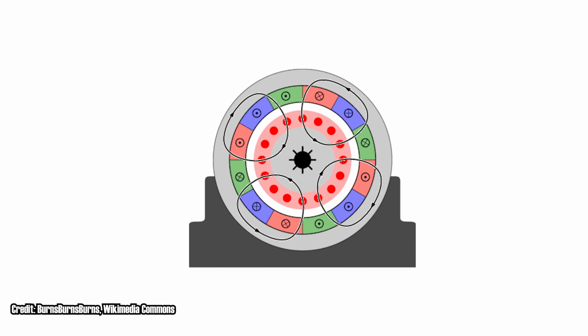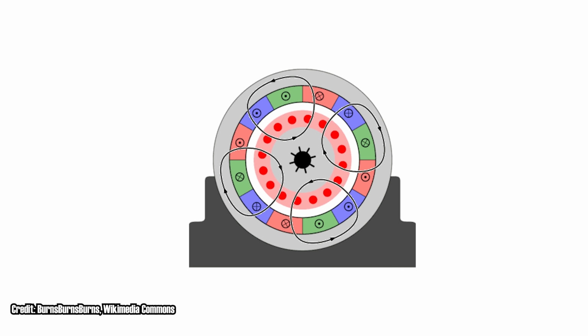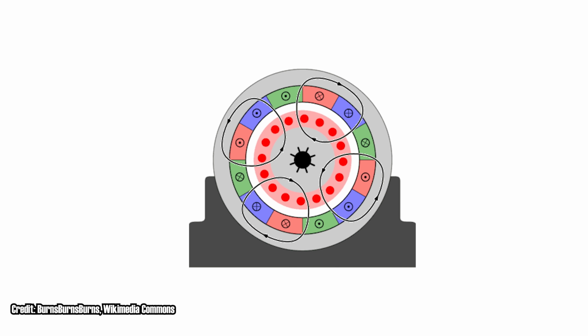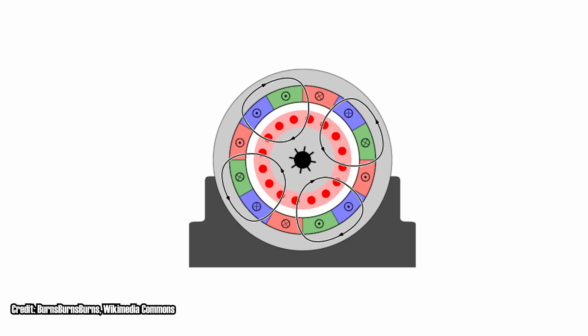In contrast, a stopped three-phase induction motor will immediately produce torque when it receives power because the field is rotating around the stationary rotor, and that means that the rotor is consequently moving through it even when it's stopped. From a standstill, the rotation of the field around the rotor will induce the necessary currents in it for it to start moving, and will accelerate until it's almost, but not quite, to the same speed as the rotating field. It never reaches synchronous speed with the field because then it would not be slipping at all and no torque would be produced. And this is exactly the reason a single-phase induction motor cannot start itself. There is no slip when nothing's moving.